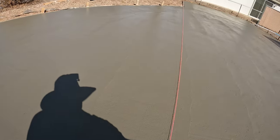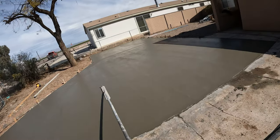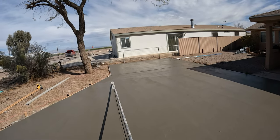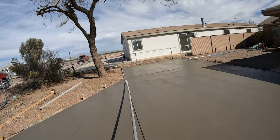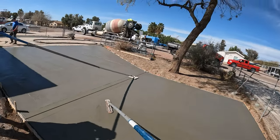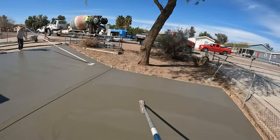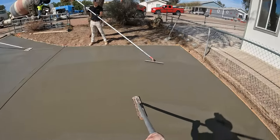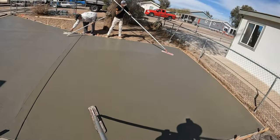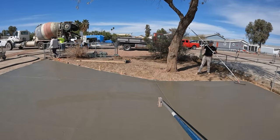For this run I said I'm going to have to put a line — it's a little too long to guess. These are the only joints I'm going to do on this large section, and then I'll come back and saw cut. We'll end up with about seven-foot squares once I saw cut it all up. This back corner will be a tough shed. Right after I jointed it, I went right to the finishing trowel to knock out the joint lines and cover up some of Big Blue's lines.